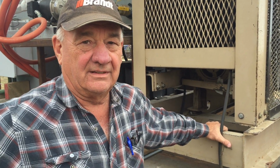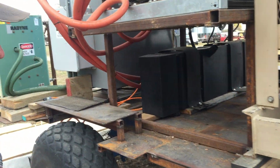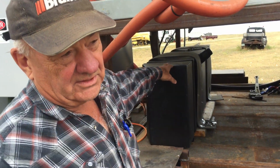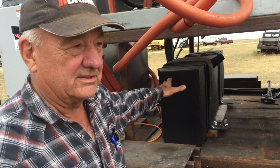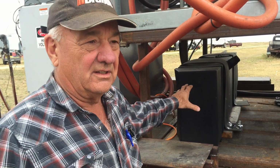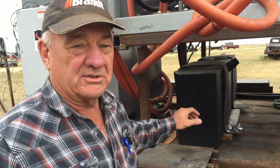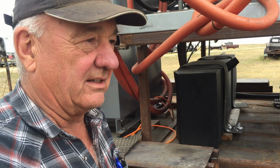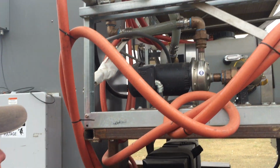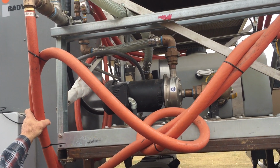Yeah. So looking at the other components, I see a water tank behind you, a small water tank for the water supply. Yeah, this is just a 35-gallon tank, and we just put that on for now because it's for our demo. But we would probably have a 100-gallon, maybe 200-gallon tank on, which should run probably 6 to 8 hours a day, because we use probably about a gallon to a gallon and a half an hour, or I mean an acre. Now the cooling unit above, you say this is drastically overbuilt and won't have to be nearly as big as this in commercial units.